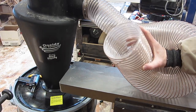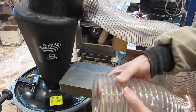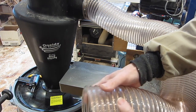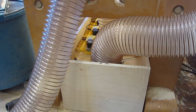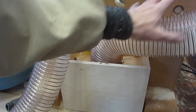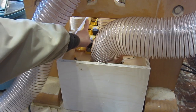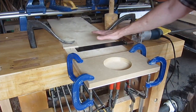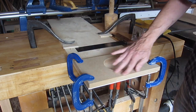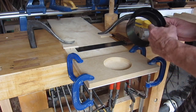A powerful dust collection approach would be to simply connect this 5-inch hose to whatever machine is being used with a quick disconnect like a mag port. But I know I would forget to move the hose, so I need an automated system using blast gates. To switch the vacuum automatically from one machine to another, I run the 5-inch hose from the cyclone into this hollow manifold box, then I have blast gates that take 4-inch hoses to each individual machine. To cut the holes in the top of the manifold, I made templates out of 3/4-inch MDF for each size of hole — this one is for the 5-inch port.